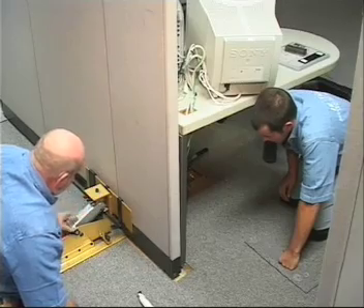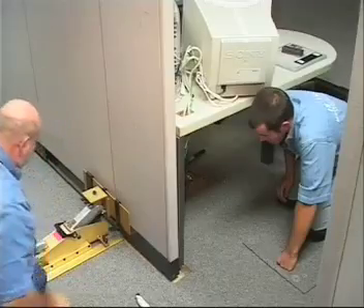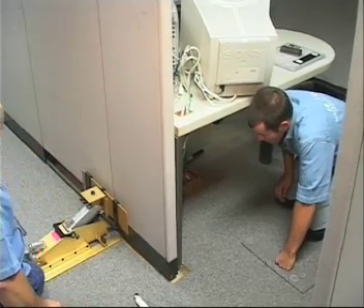These spline walls aren't very strong, and if you go into them a lot of times it'll rip the spline wall right out. A lot of your systems have overhead gondolas hanging on them, making them very heavy. When you start lifting on a spline wall like that, it rips them. By using this lift, you're eliminating damage to the system furniture itself.